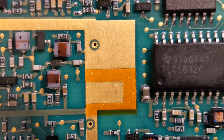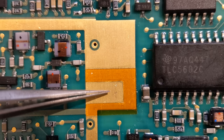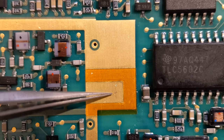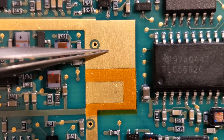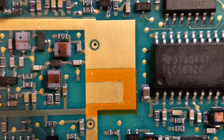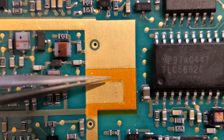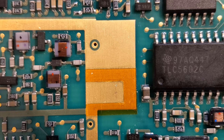Moving on to the last of these short demonstrations. I'm going to attach two wires to this unresisted plane — this is the area where possibly a can would go on. Clearly from above, hopefully you'll see how the first one stays within the Kapton border. I'm going to do another wire here and you'll see the solder spread beyond where it should go. This solder spread can be critical on some boards. You may come across a board where you really need to contain solder in a certain area — hopefully these videos show this is a great method to do it. I've put Kapton around this area, will stick a wire in here, and hopefully the solder stays within that border.